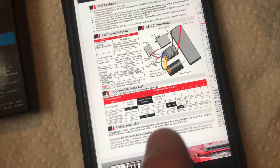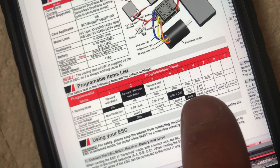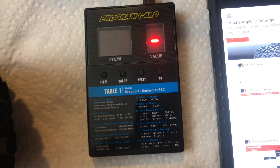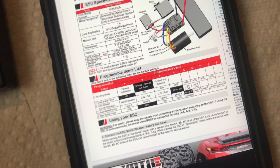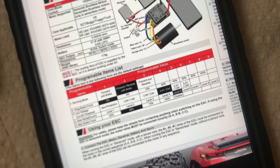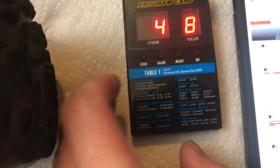I don't even know why they have 2.6 or 2.8 volts as options because you really don't want to run that low. I think it's dangerous going below 3 volts on any lipo pack. I'm going to change that from value number four to value number five, which is 3.2 volts per cell. All you have to do is go in and move the value up one more to level five — 3.2 volts — and then press OK. Item number four is the start punch mode; the default is level five, but I want to be doing standing backflips in the air, so I decided to bump it up to value number eight out of nine different values. We're going to leave that one just how I have it. Then item number five — the last programmable setting — is max brake force, set at default 50%, so we're going to leave that at 50%.